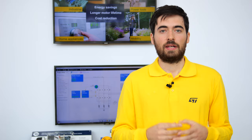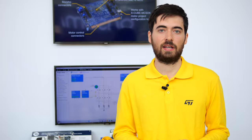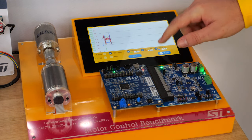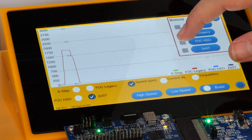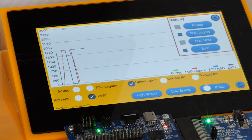Also, switching direction is smooth. The second demonstration enables the comparison of several motor control algorithms under braking conditions. The braking is performed by another brushless DC motor, and the UI enables you to apply a resistive torque to the motor under test. You can choose the algorithms you want to benchmark, to make comparisons on current consumption, start-up time, and even recovery after mechanical stall.